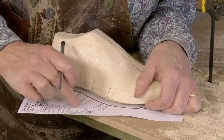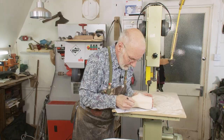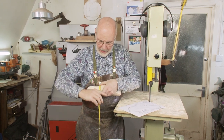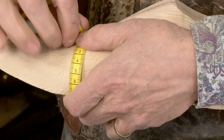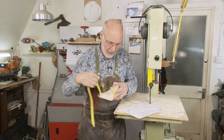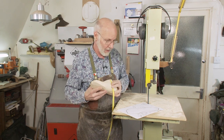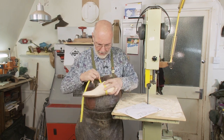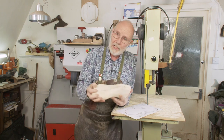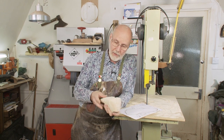Let's check the measures — this is the first time I've checked them. I'll put the tape on and see how we're doing. The joint measure says 270, and there we are at 274 — great. Behind the joint: 263, and it's 267. The step measure: 264, and it's 268 — got four mil to play with. And 275 on the top versus 290 — so we've got 15 to play with there. We're really, really close.